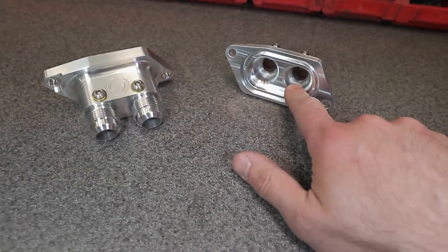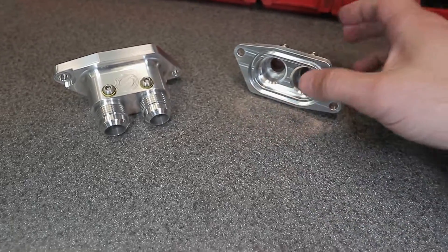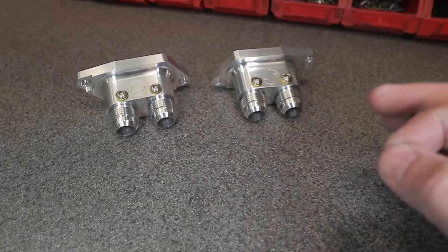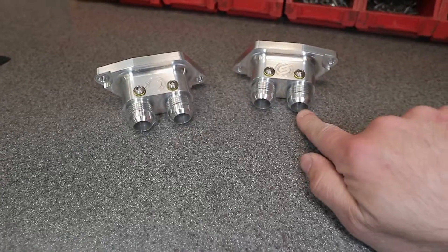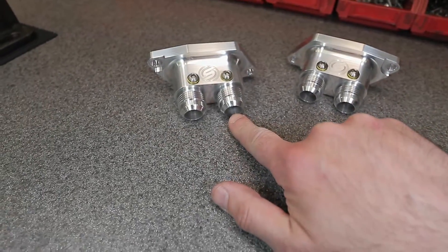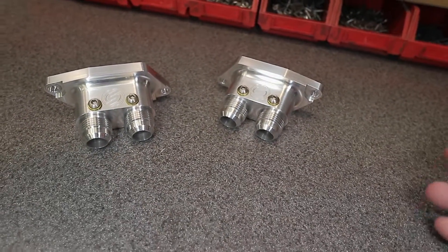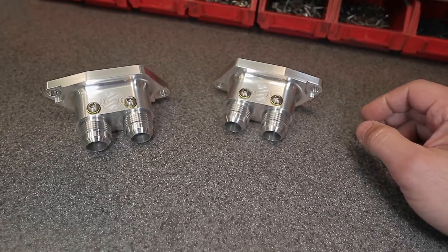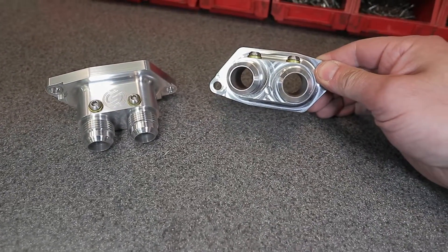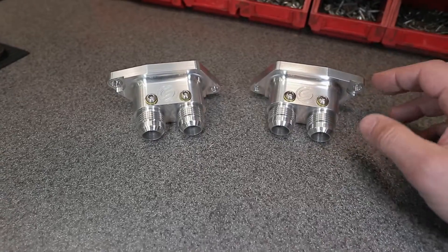To take advantage of these inlets you need the Synergy water couplers, which go in here — they have two o-rings and couple to the brick. The Synergy water adapters have an inside diameter of 700 thousandths. The v1 here measures 649 thousandths of an inch — just over five-eighths of an inch — but the newest v2 versions have a full 700 thousandths, giving you a little more opening and more flow.